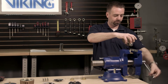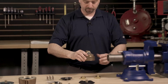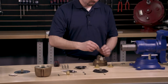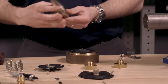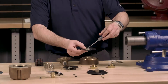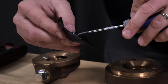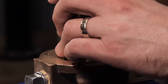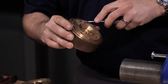To remove the additional parts, the accelerator will need to be turned over so that the base is in the upright position. Remove the four screws from the base and separate the base from the housing. Next, we can remove the clapper diaphragm, then the U-cup retainer and U-cup from the clapper diaphragm. Now the seat can be removed from the base, and the screen filter can now be removed.